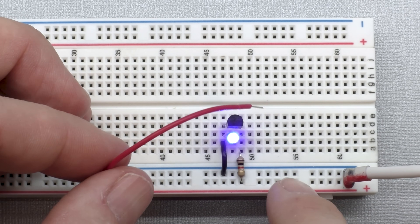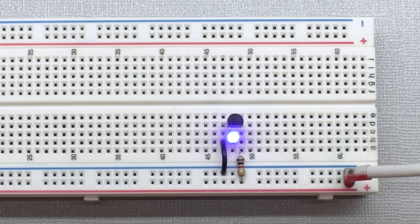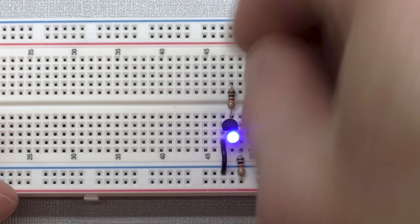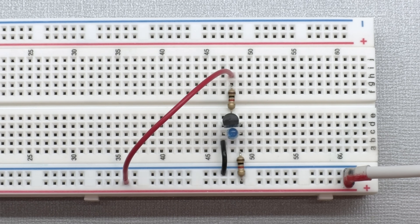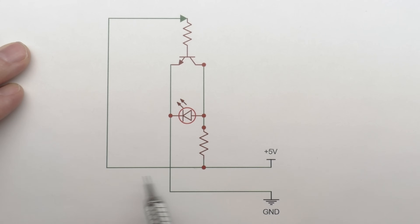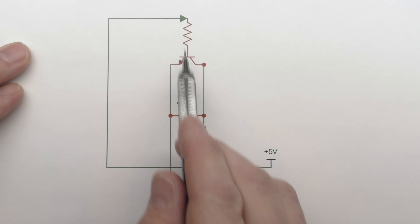I just did something very bad — I wanted you to see that in this case we were okay, but sometimes you'll end up blowing your transistor by doing that. Why? Because we didn't have a resistor. Resistors are our friends — they help regulate and limit current flow, because too much current will harm things. We're going to add a resistor to the base. When we power that base up, you'll see it activates the transistor, which turns the LED off. For clarity, here's the schematic: power comes through the resistor into the base of the transistor, activating it. If this is not active, it's like an open switch — there's no connection.